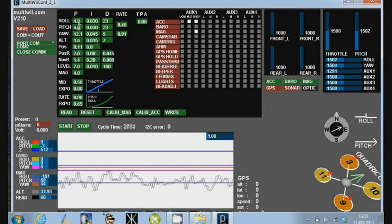The basic PIDs are pretty much what's at the top for 4 and 4. I found that I needed to increase the proportional settings on this one quite a lot. I found that the yaw or rudder was very soft for me. I also improved the rate.